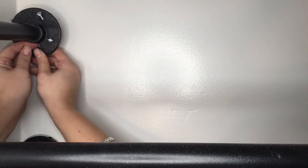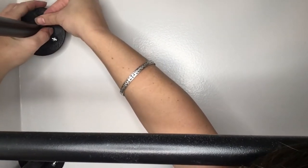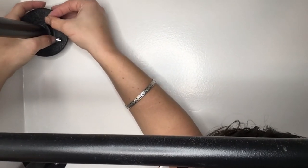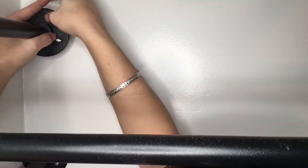Get your finger back there and push them all in - don't push them in too far, just get the toggle kind of wedged in the wall first. Once I get all four wedged in the wall, then I will push the screw all the way in, making sure the toggle gets past the sheetrock so that it will bust open into that T-shape. Once it's in that T-shape, then you come back in with your screwdriver.